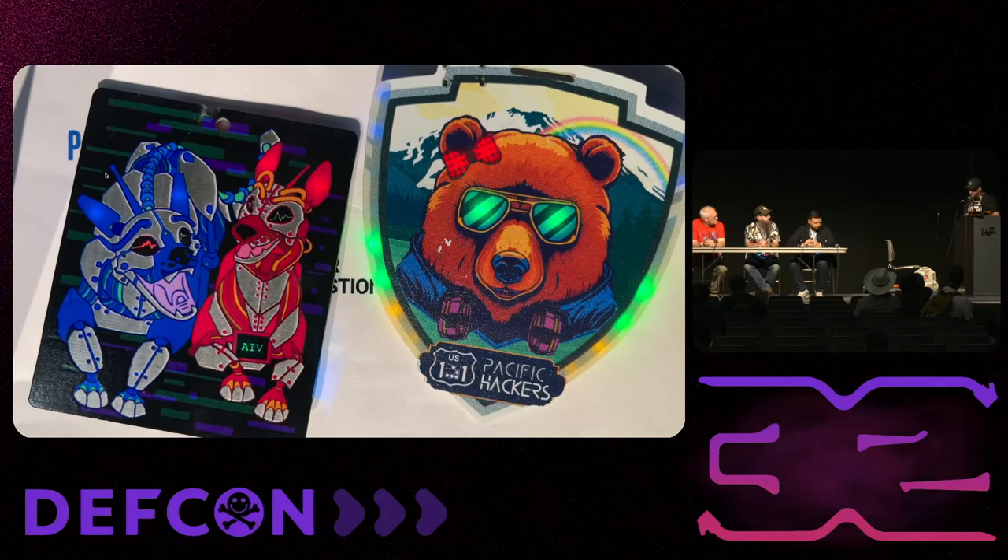Question for Hamster: if I'm ordering badges, how many extras should I order to print, test, and perfect the process? I typically order between 25 and 30 blank extras. I usually end up using both front and back of them to dial in color temperature, artwork registration, and so on. If you're still undecided about what the design should look like, bump that number up. I usually do runs of about 100 badges, so it's a substantial number, but cost-wise it's really not much money.